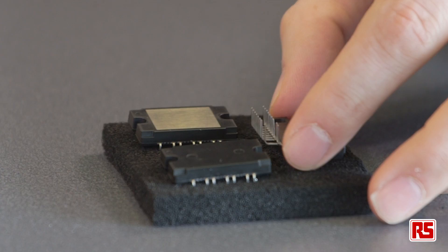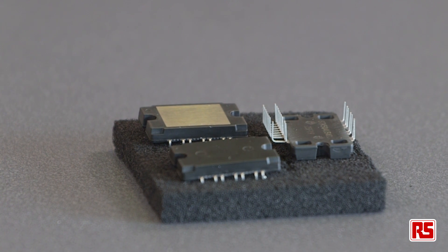The configuration of the modules is such that the three lower side IGBTs have available emitter connections. This gives you maximum flexibility in the choice of the algorithm to control the module. The power stage has a full range of protection functions including cross conduction protection, an external enable pin and under voltage lockout.